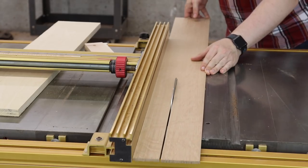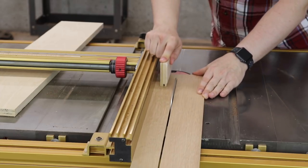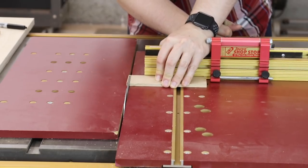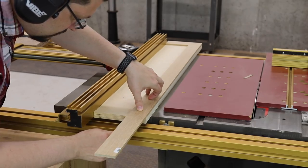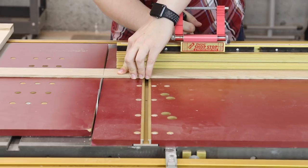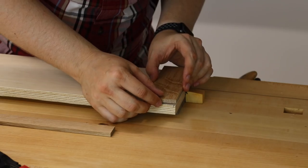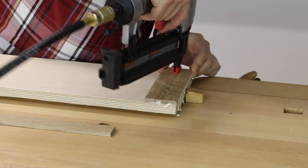I'm going to rip a piece of quarter-inch quarter-sawn white oak that I bought at the woodworking store to two inches wide. Then I rough cut that strip just a little bit wider than six inches, come back and cut it to six inches long. I take the two-inch wide piece, put it at the end, butt my long piece up to it, and make a mark on the bottom. I bring that to the cross cut sled and cut it to length, then rip that piece to an inch wide. Get some glue on the bottom, line it up, and shoot a couple of brads in to hold it nicely in place.